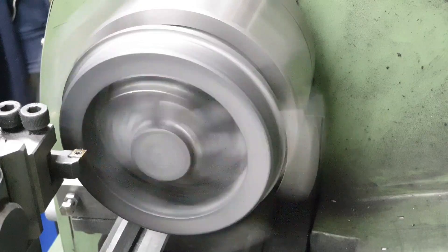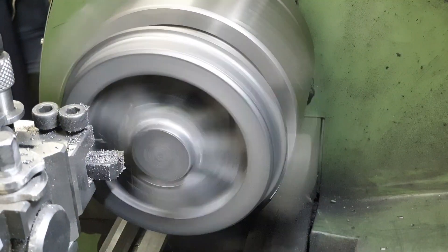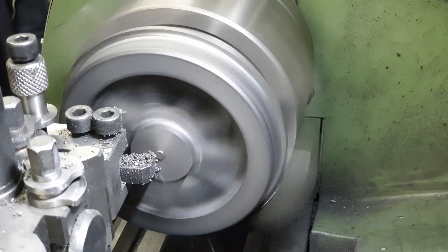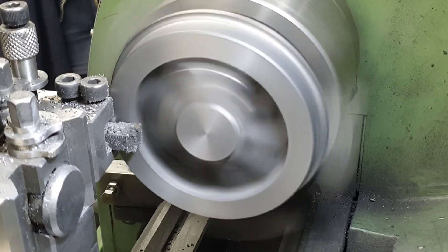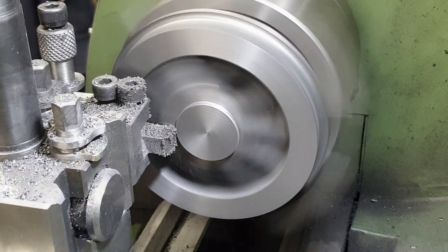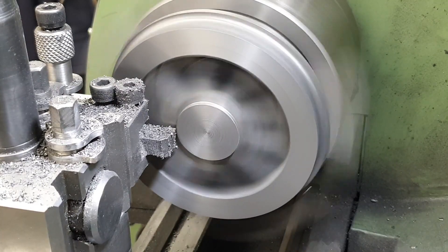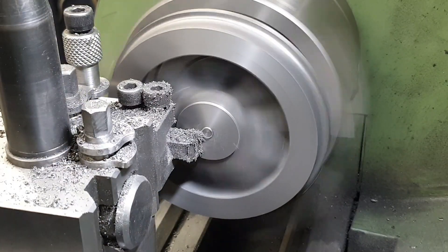Because it's sitting the proudest I deal with the crank pin boss first. Then I face off both the boss and the centre hub. The centre hub needs to be 1.6mm proud of the rim, so I carry on facing off both the rim and the boss for the crank pin, put a finish cut on those, and then put a finishing cut on the centre hub with that 1.6mm offset.